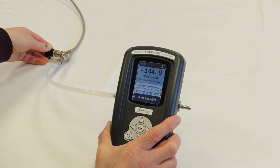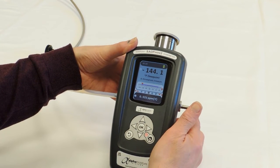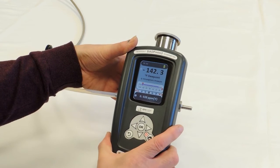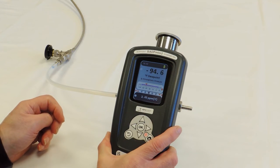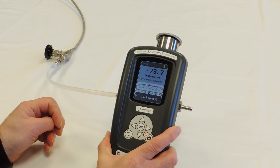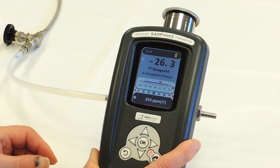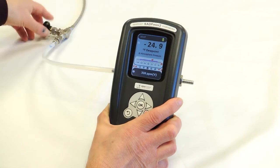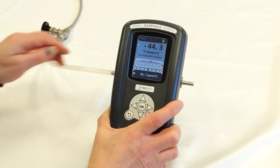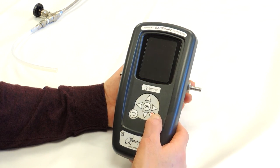Once you've purged through the instrument with the head closed, raise the head by blocking the outlet of the Mini 2 like this. The head will rise — release it and you can see the dew point reacting immediately to the change in moisture content in the sample gas. Never pull the head up manually because this will allow moisture to be drawn in through the outlet connection. When the reading has stabilised on the display, you can record the reading. When the sampling is finished, close the head and close the isolation valve, then disconnect the sample line from the instrument. To turn the Mini 2 off, press and hold the home button for at least two seconds and you'll see the screen go blank. Thank you for watching.